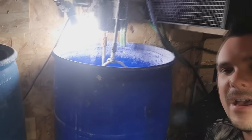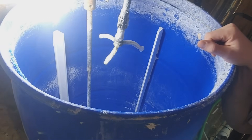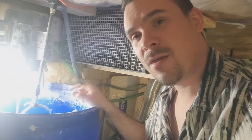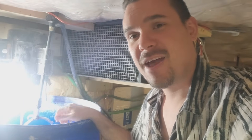So how do we mix everything? We use these two 55-gallon drums as batch mixers, and with the batch mixers you can put out some pretty high volume. At the bottom here, you'll see there is a dispersion blade, and that allows us to have high shear mixing. Right behind me, we have a negative pressure air filter that takes the fumes off the top of this while it's mixing and directs it outside and filters it. The other nice thing is that these mixing drums clean themselves.